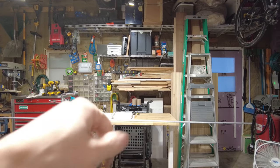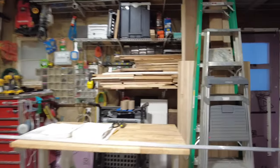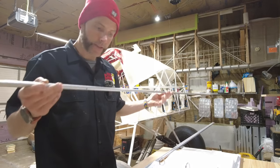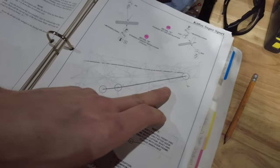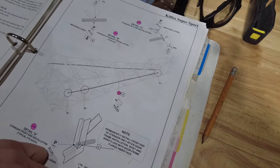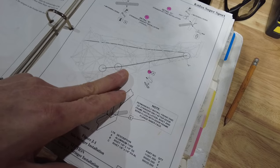As you can see, the stringer material is on top of the workbench — there are three of them, pretty long, about 10 feet. You'll notice one is shorter than the others because I measured carefully and cut it, and that's the piece I cut off. What happened: I laid this one out for the co-pilot side, measured from point A to point C, and back at C you have a round tube meeting another round tube, so you have to cope out the end of the stringer. Once I started coping, I came up short on end A. I don't believe this is a structural member — I think it's there as a bearing surface when I put fabric over it — so I have another phone call to make to Brandon.